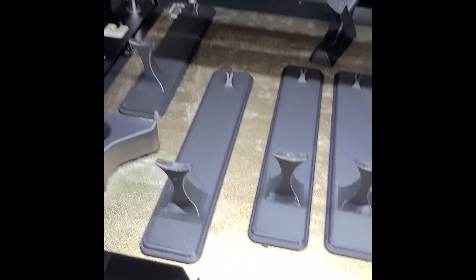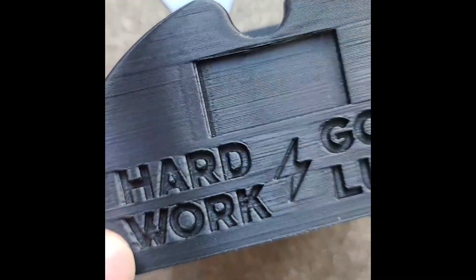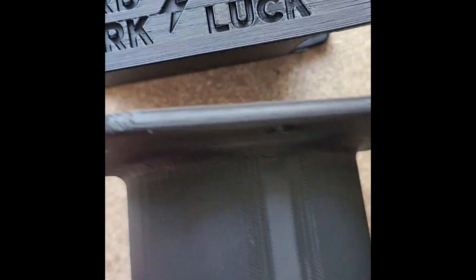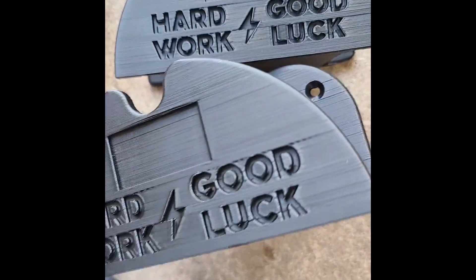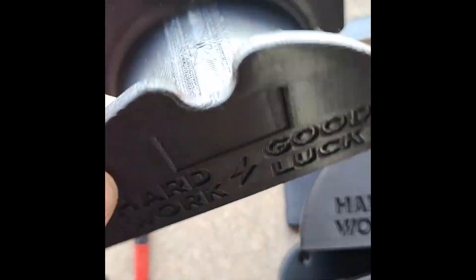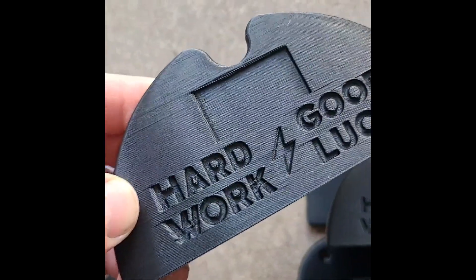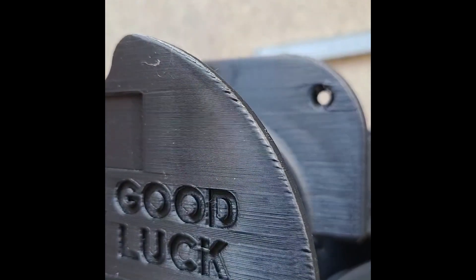In conclusion, once I altered the filament feed box in the back - which was a nightmare, the worst thing about the design, being on the back so it's very hard to get to - I bought an external feed roll with a built-in dehumidifier/dryer and put some new Bowden tube on it. I figured just under a meter is the maximum you can use - any more than that seems to bind up. Once I did that and found a final place for it, it fixed a few of those little issues. I've been running a year and just bought new nozzles - I eventually got a blocked nozzle from messing around with that Bowden tube.